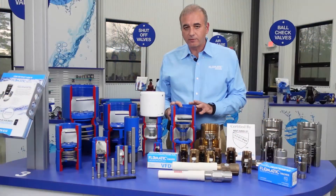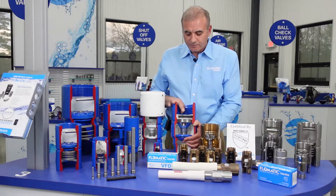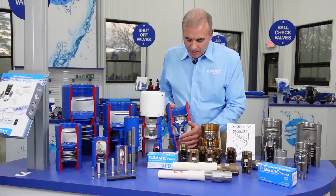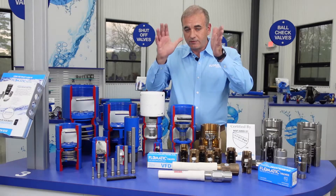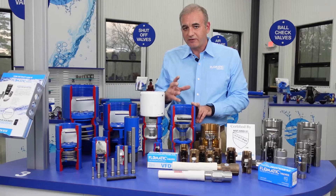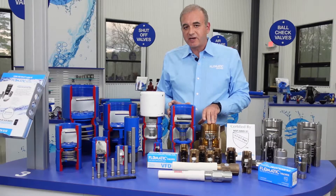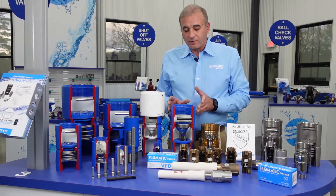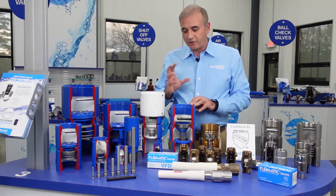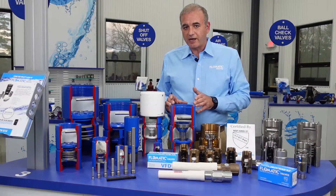These check valves are much more flow efficient and they can handle low flow because of the precision guided oversized shaft. We have a radius seat design that gives us laminar flow through the valve. We want laminar flow — we don't want any spinning motion inside the poppet or turbulence inside a check valve. One of the damaging effects on check valves is turbulent flow. Just like an airplane encountering turbulence, the check valve will be fluttering around, so check valves need laminar flow.